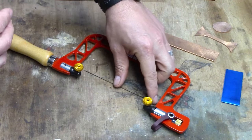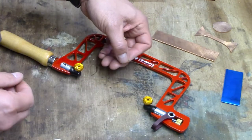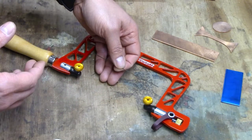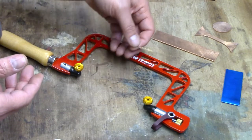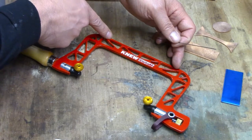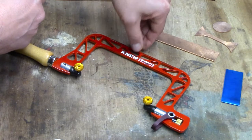What you want to do is get your blade. This will work for your standard jeweler's blades, which are about 5 and 1/8 inches long. If you're ever worried about whether your blade is long enough or too long, the frame itself has measuring points where you can lay your blade against it and confirm that it's going to work.